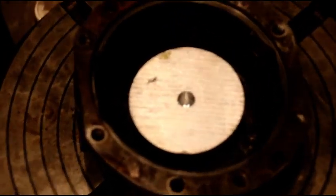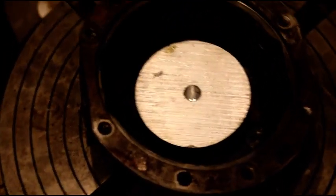Okay, here's setup number two. That's my rotary table. I have a pilot there — it just fits in there perfectly. And I can always center the rotary table easily. And that locates our knuckle. Then I clamp it down and remove this guide.